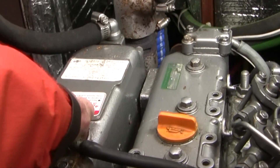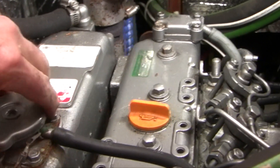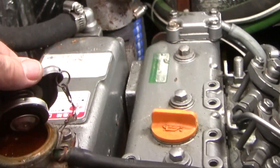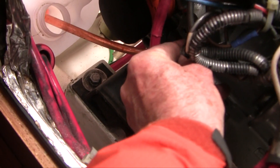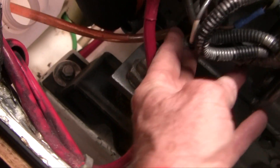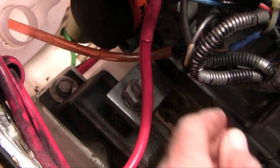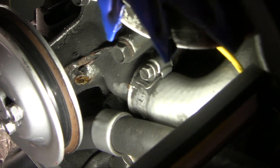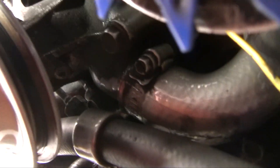Now let's remove the cap. That's the color of my fluid there. Now it's coming nicely — I just had to loosen that off a little bit further. So while that fluid is draining, let me give you a look at where the weep hole is. It's right up there — you can see it. It's got a brownish discoloration from the liquid.